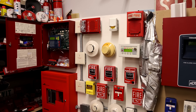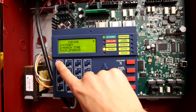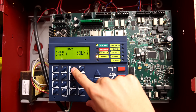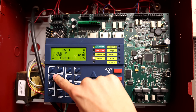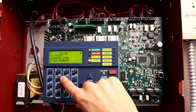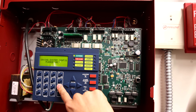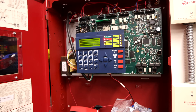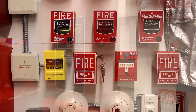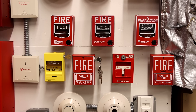And we're completely reset. So this is the light plate and we're going to change it from March time to steady. And then I believe the horn is on NAC4, and we're going to change that from Temporal to March time. That'll be interesting. Panel is reprogrammed.